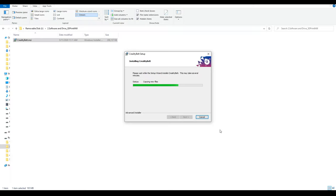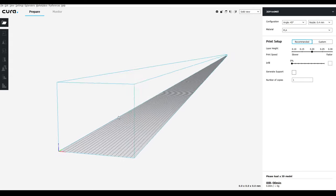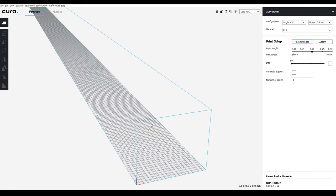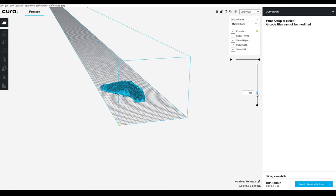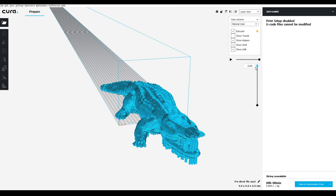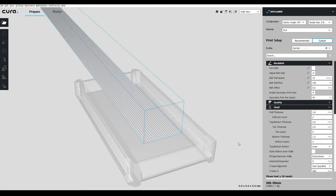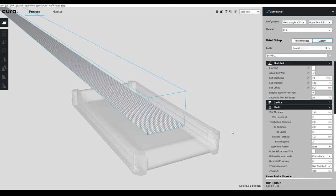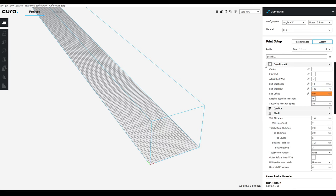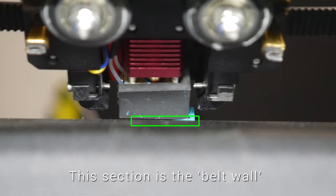Fortunately, we have two to choose from. Option 1 is found on the SD card that comes with the printer — it's called Creality Belt, basically a skinned version of Cura set up for a belt printer, where Z goes for a very long way. If we import that same G-code, the crocodile all of a sudden looks like it should. Option 2 we download from the Black Belt 3D printer website — it's another modified version of Cura called Black Belt Cura. As far as I can tell, it's very similar to Creality Belt; both are based on Cura and each has a custom section dealing with parameters specific to these machines. For instance, the belt wall speed will be slowed down so extrusions made at the base of each layer have a better chance to adhere to the belt material — go too fast and parts will curl up on the edges and eventually fall off.